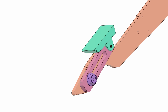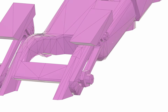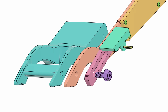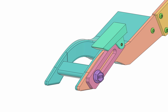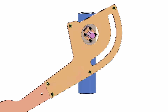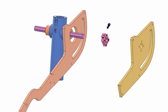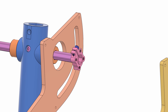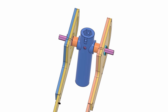The undeployed feet just sort of dangle near the rear. Since the game model has a needlessly large bolt holding the foot slot in place, I too added a needlessly large bolt that screws into the foot assembly, and into the weird forked spacer piece between the hind legs. In order to lock the core of the base to the legs, the inner plate has a large hole where the hex shaft will go, because I added a hex shaft collar to either side. The collar tightens around the shaft, hides within the inner leg plate, and then is fastened to the outer plate for the full rear leg assembly.